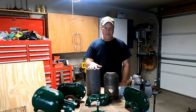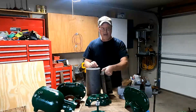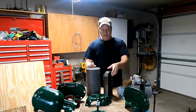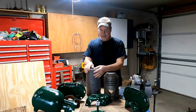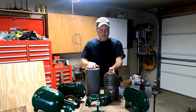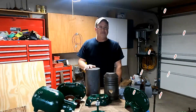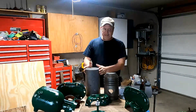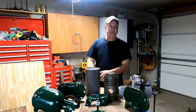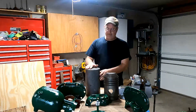In this video we're going to get started on the piston. As you remember, this engine came with a piston but it was in very bad shape, so I cut it in half and made a pattern — I'll put a link to that video in the description. I had three piston blanks cast, about 45 pounds apiece, and they are hollow like a regular piston, but they need machined: all the ring grooves, the taper on the end, the wrist pin hole. These castings look square and straight but they're not — there are no straight surfaces on this casting at all, which is pretty hard to machine with.